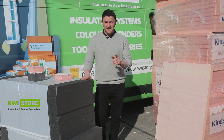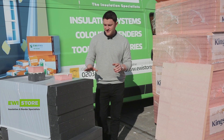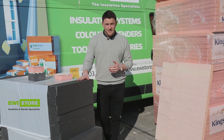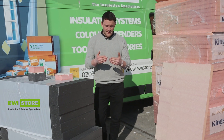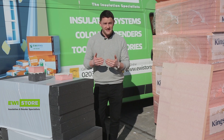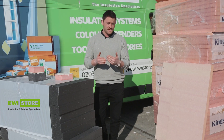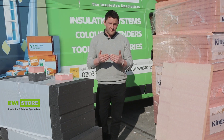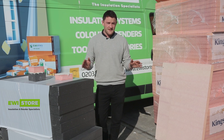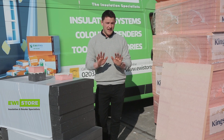The primary difference is when you're sticking the boards to the wall. With EPS, if you had a slightly uneven wall and you used adhesive to stick the boards on and had a bit of an overlap or it wasn't perfectly flush, you could just rasp down those boards to get a nice even surface after installing them, giving you a nice level base coat.